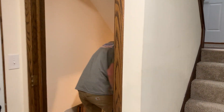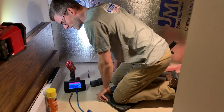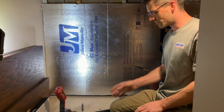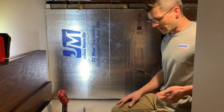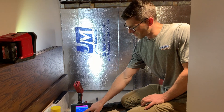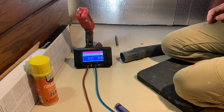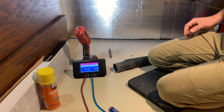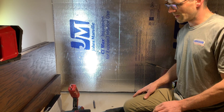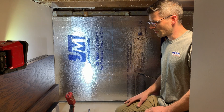If you follow me under here, I've got one of my test holes — just a half-inch hole that I drilled through the concrete slab. We've got four of them in the basement so far. I've got one just under the steps here a few feet behind me, and then this blue one is actually the mechanical room on the other side of the basement. When we install a radon system, we want to get three pascals in the winter. Pascals is a unit of measurement of suction or vacuum underneath the basement floor. We go into that in some of our other videos.